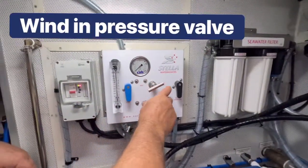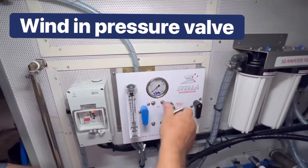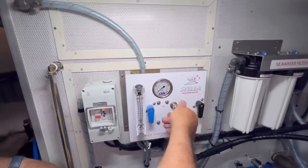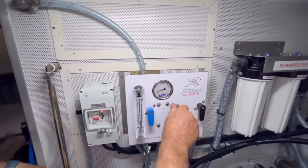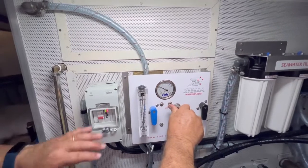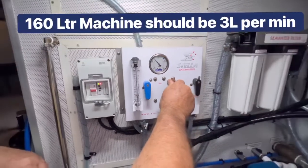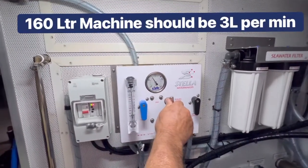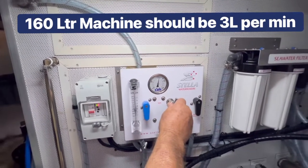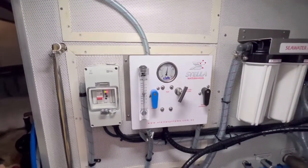Pressure's wound right off — we simply bring in the pressure at this point. In this instance, given the water we're running in, we know we're going to be running at reasonably low pressure to make water. Wind in the pressure, and with a 160 litre per hour water maker, run the pressure up until the flow is showing on the top of the float at approximately three litres a minute. We clear a bit of air, and typically our blue valve here is set to discharge product into the tank, because we know this system has just been running with clean water.